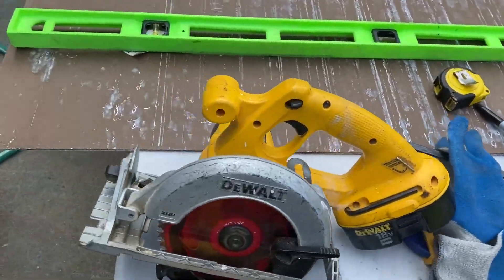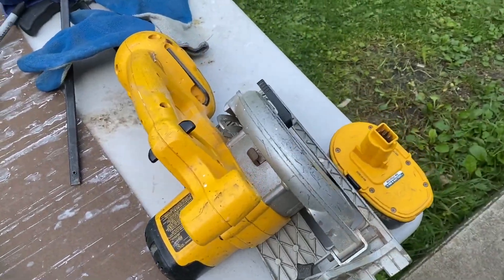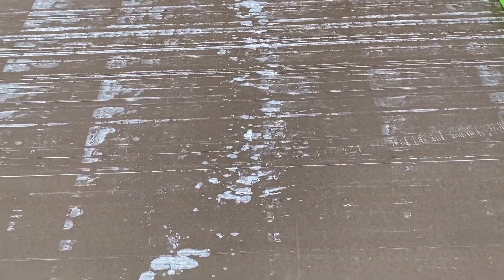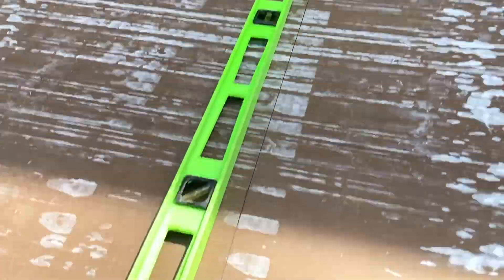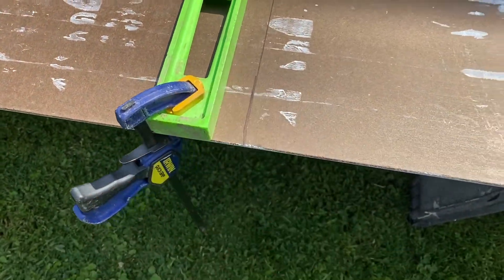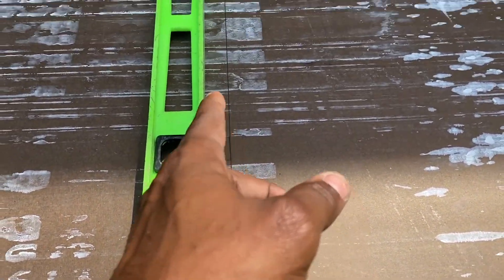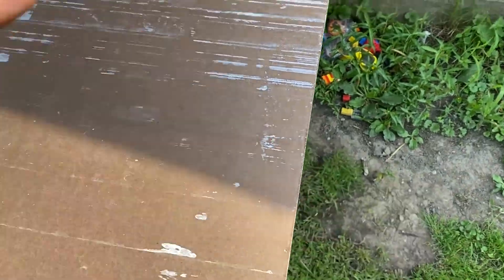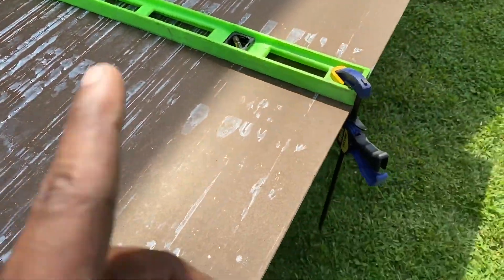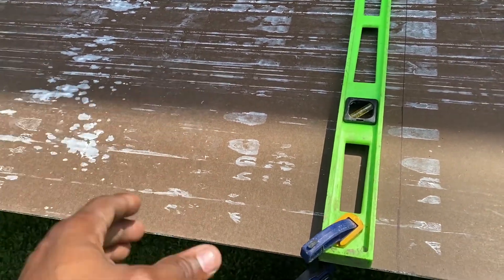So let me start cutting panels. I got one of my panels out. I'm going to clamp this down to get a straight edge for the circular saw. You want to cut these panels always from the back to get a clean cut, even though the trim is going to cover the rough edges. My straight edge is clamped down, so I can just run a smooth cut with the circular saw. I can just come as close as I can to this line and take my time, placing the rough part towards the bottom. Both of them will be hidden by trim.